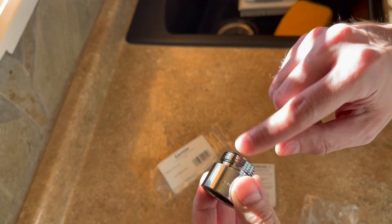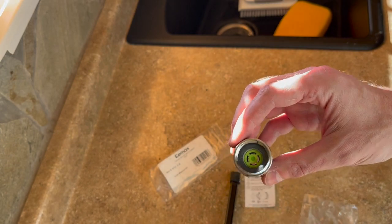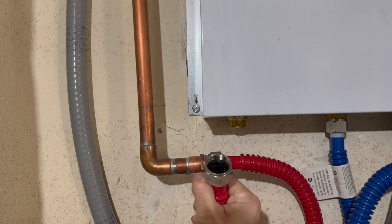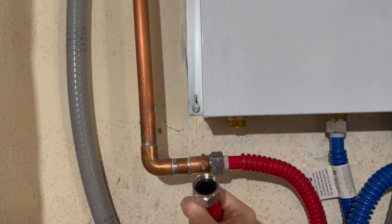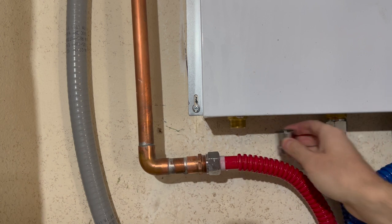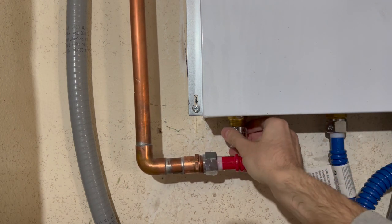You can see inside here, this rubber washer creates a compression fitting, so you shouldn't need any plumber's tape here. I'm not sure about the other side — let's go look. Back here at the water heater, you can see there's actually a rubber washer inside there as well, so that's also a compression fitting — no need for plumber's tape on this side either. So I'm going to install the flow restrictor up here at the outlet of the water heater.